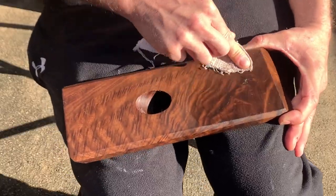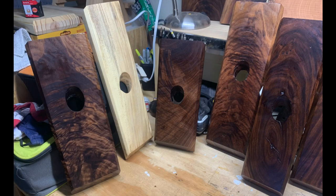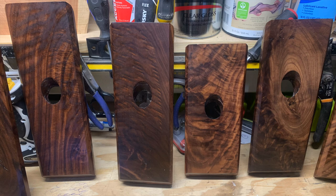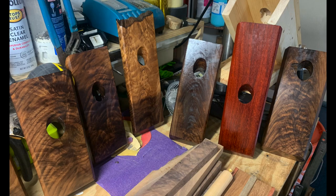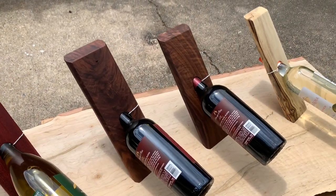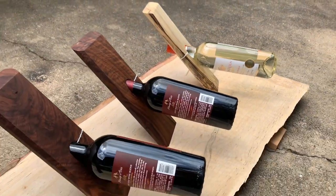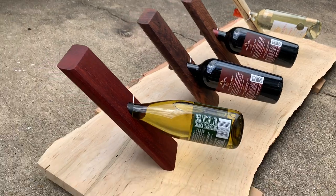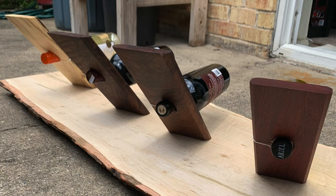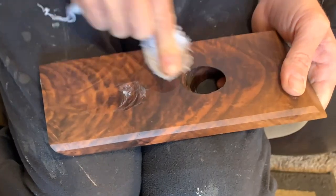This part took quite a while, but was worth every second. These display boards came out very smooth and were worth the time and effort to make them, and I'll definitely be making some more in the future. All of these are between 3 and 4 inches wide, with the exception of the very first one I made, which is only 2 and 7 eighths. I think my favorite ones ended up being the longest ones at 13 inches. Start from the top of your board, measure down 5 inches and make a mark — this is where the top of your hole saw bit will first touch your board when mounted on a 45 degree jig. If you drill it this way, the hole will be pretty close to the center of the board on both sides, making it so you can display a full large wine bottle on either side.